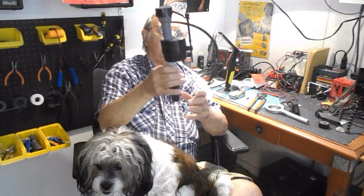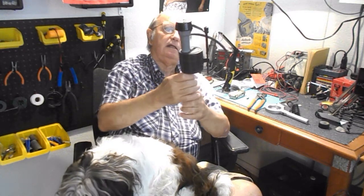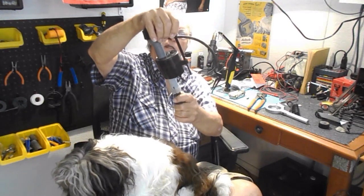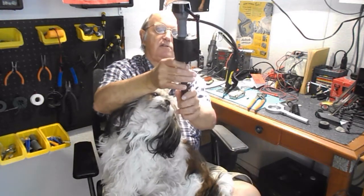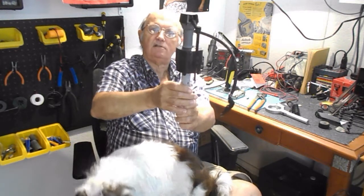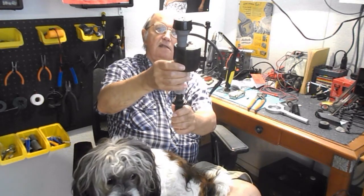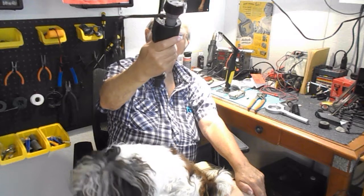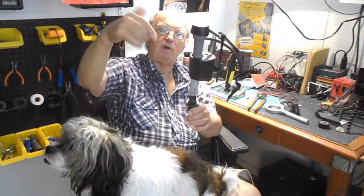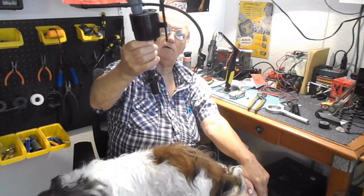Here's the filler tube that goes inside the center part where the water goes through. This adjustment supposedly adjusts something, but it doesn't. It does not shut anything off — it was like this and never came up all the way to shut off, so it just kept on filling up the tank until it started to overflow into the center pipes and go back into the toilet again. Totally water wasteful.